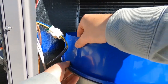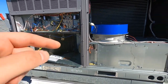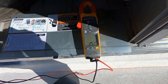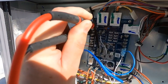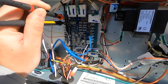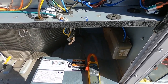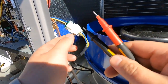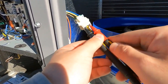Let me show you the voltage real quick and then we'll go from there. I've got 25.6 volts, and that is coming off my G terminals on the board here. As you can see, I've got the fan — now I'll show you the high voltage side going to the motor. You can see three legs tapping right in here like that.